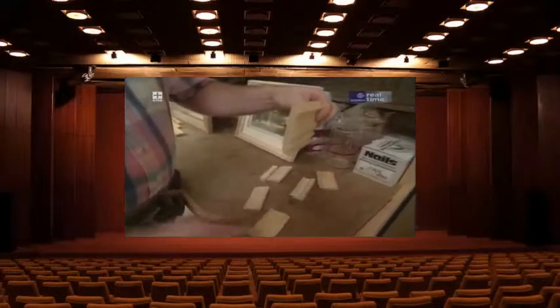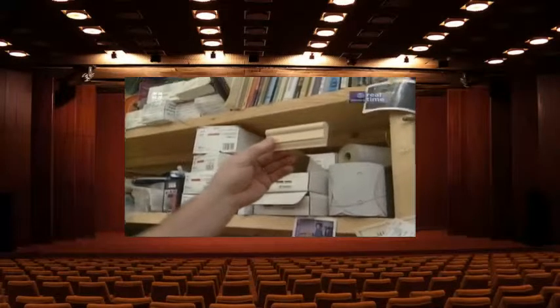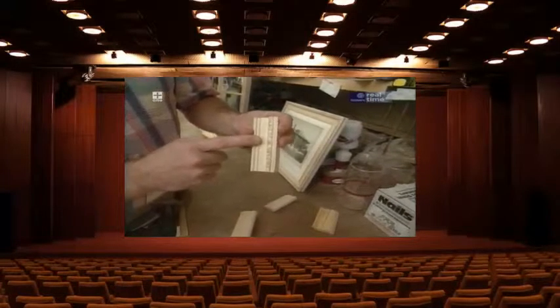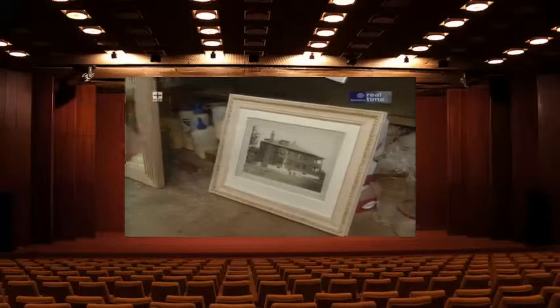Choosing wood for the various frames: pulling out some stock moldings from the lumber rack — a crown molding and a cornice molding — but there's not enough wood and there's no rabbet to support the picture itself. However, one molding available at the home center will work: a picture molding usually placed on the wall up high where you place a hook around the round portion to hang pictures. Adding a piece of wood to the back side gives a rabbet and it's actually quite a nice profile. Another option is a decorative molding from the home center — not carved but pressed — which comes in eight-foot lengths and already has a rabbet in it, making it good for picture frames.